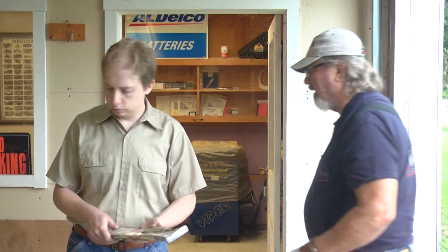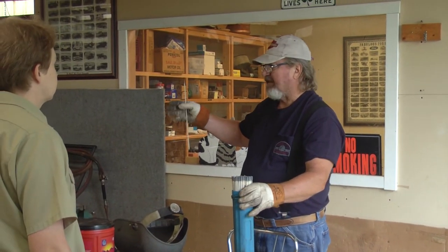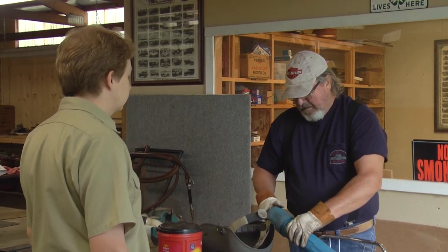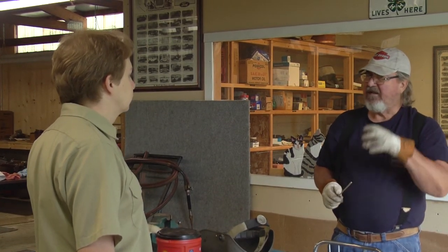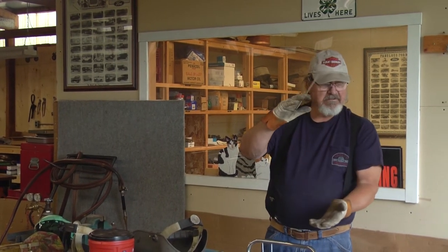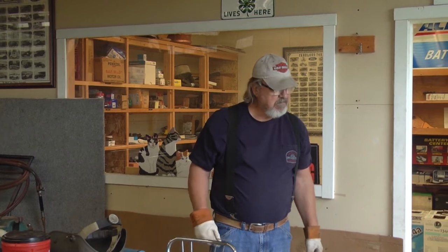60-13 is a good electrode. What I do is I buy these canisters right here. At home I've got an old box with a light bulb in it that'll keep all my rods to keep them dry. If you don't have that, you can use these containers. The rods are going to get rusty and the flux gets all wet. Any time the flux is getting wet, you're putting hydrogen into the weld. And that's one thing you don't want — water trapped in your weld causes cracking. So that's why you want to keep your electrodes dry.